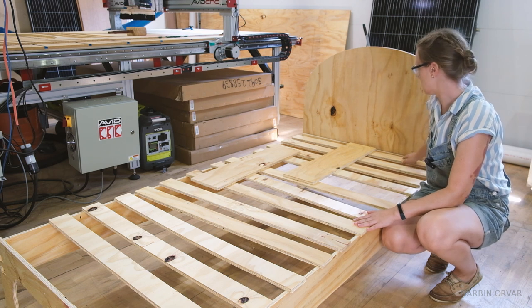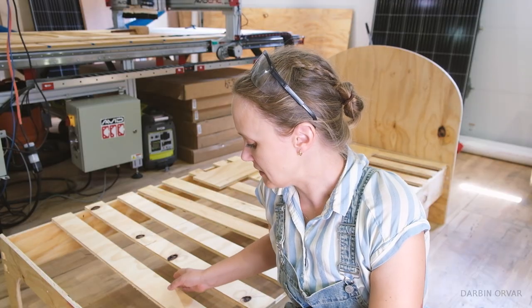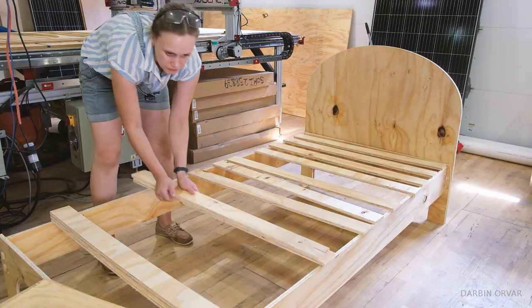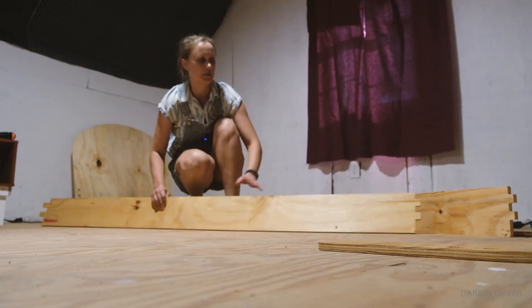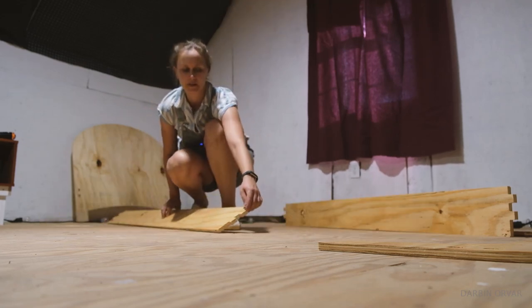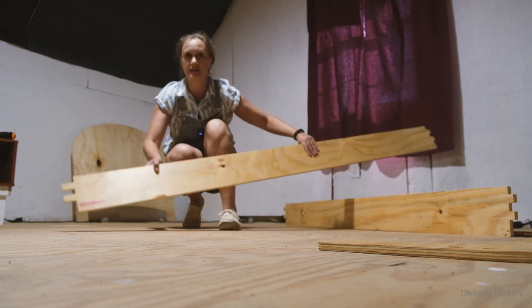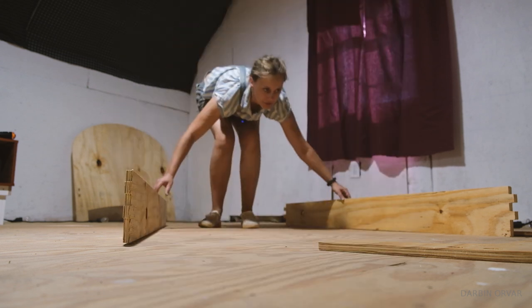So I think we've got plenty of slats now — 12 slats. Debating whether to use glue and a nail gun, a staple gun, or screws. Since this is going right upstairs, people can just assemble it up there. On the rails we have box joints on the sides — the shorter ones go towards the end and the longer ones go towards the front. They will connect to the headboard as well.